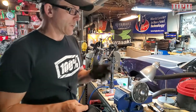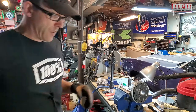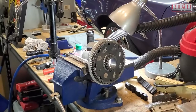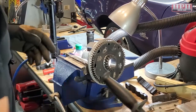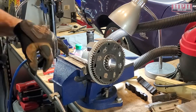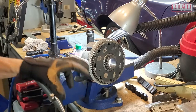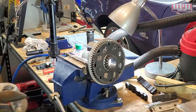Make sure you wear gloves and glasses — safety glasses especially, but I wear regular glasses so that'll do for me. We're going to make some noise and show you how we grind off the pin. Now, we're going to use our angle grinder. You may have another tool, but it'll need to be something powerful. I put a little bit of cutting fluid on each one as well, just to help it cut through the metal. We have one left here and we'll show you how we do it — it's going to get loud.